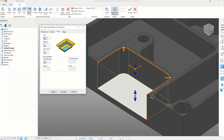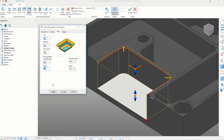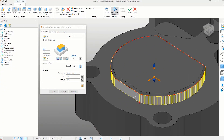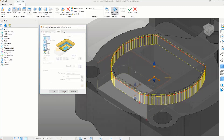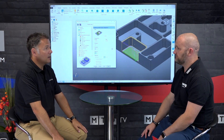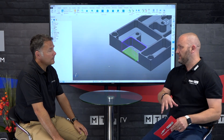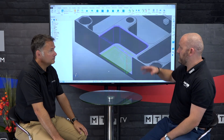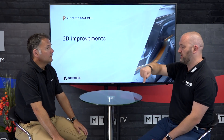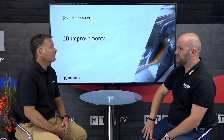The second enhancement, as you can see in this video, is that when we've selected a surface, PowerMill automatically analyses and identifies that this particular feature is an open pocket, and creates an open pocket type for you. Meaning that when you go to create your roughing or finishing machining strategies, PowerMill intelligently knows it can approach the pocket from the open side and generate a more efficient strategy. In legacy products you would have to create it as a closed feature or pocket and almost work around that. Creating an open pocket inside PowerMill could have been easier in the past, so we've identified that and made it easier now.